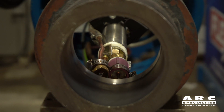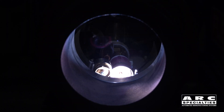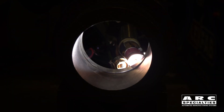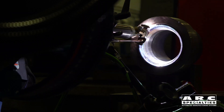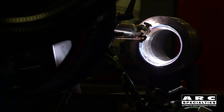We're going to be breaking a number of rules. Most robots are MIG welding — this is TIG welding. Robots can only rotate a torch possibly two revolutions normally. What we've done is come up with a seventh axis fitted to this KUKA robot and integrated into the control system. We're using slip rings to conduct the weld power, the hotwire power, servo wire feed, the gas, the water, and even video signals.